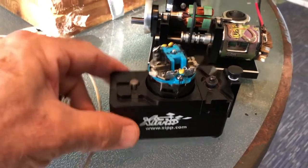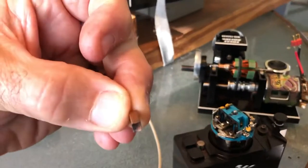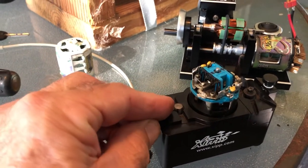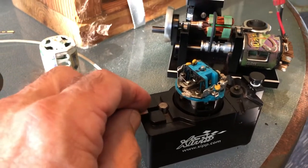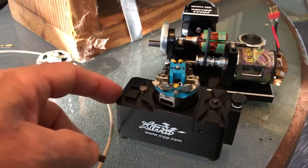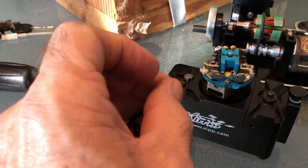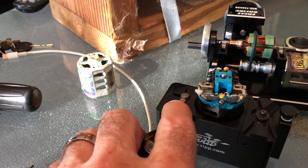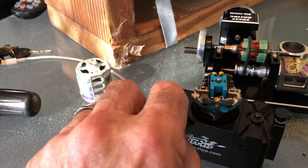Here is a vertical brush slot — you put the brush in this way, vertical, for vertical end bells. You can go in and push the brush in as the motor is running, and it will spin this blade and resurface, giving you some grooves on your brush. Then there's the horizontal brush slot — you push this in as the motor is spinning, the belt is spinning this blade over here, and it will resurface and re-groove.